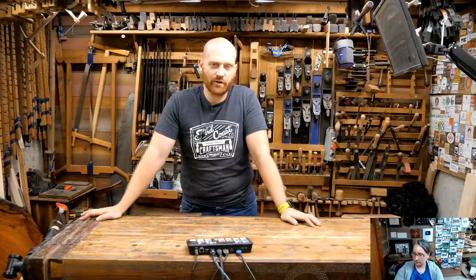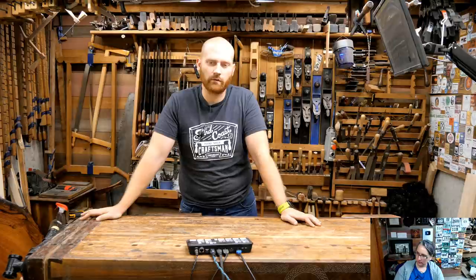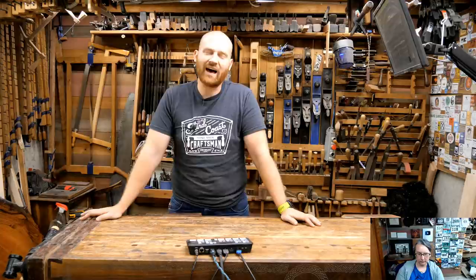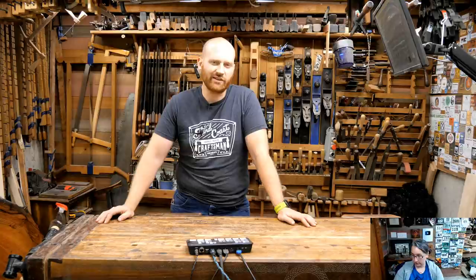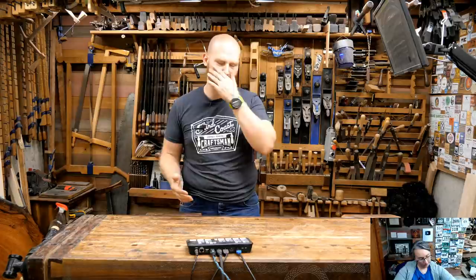Yeah, thank you, Harold. You put a whole bunch in there. I want to restore some old hand saws. Can you talk a little about how to deal with rust and pits in the saw plate? Yeah, I have several videos on that. And once you start talking about saw restoration, you will see way more answers than there are saws to be restored. There are a lot of different things out there, and different people will swear by different techniques. For me, I like WD-40 and sanding. If it's fairly light, I might scrape it off. I'm not a huge fan of scraping, unless there's an etch to protect. If there's an etch, then scraping is generally the way I'm going to do it, or I'm going to be using a stiff block on a sanding block.